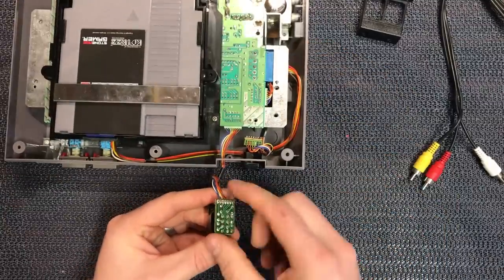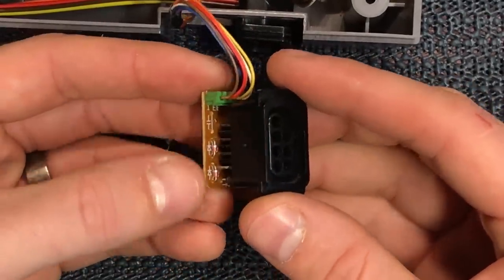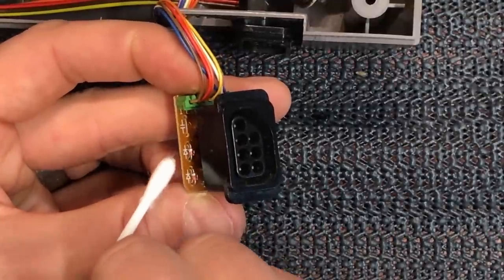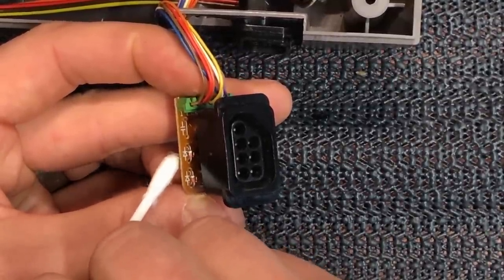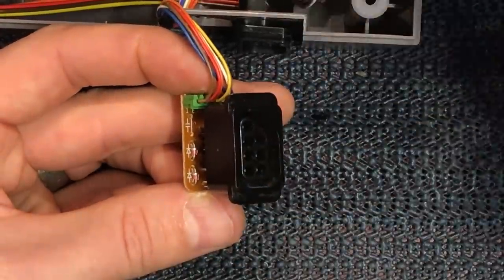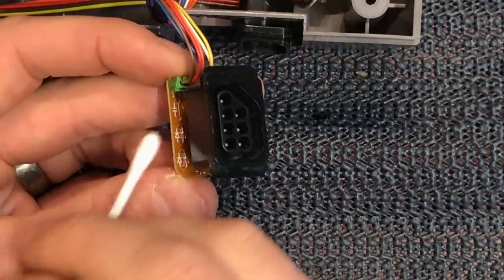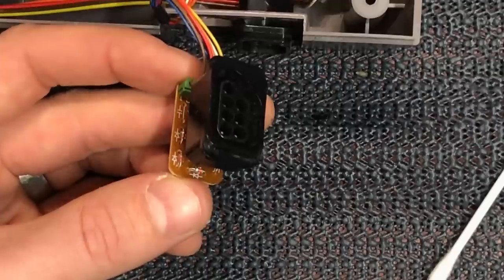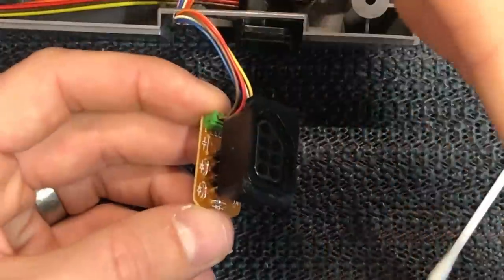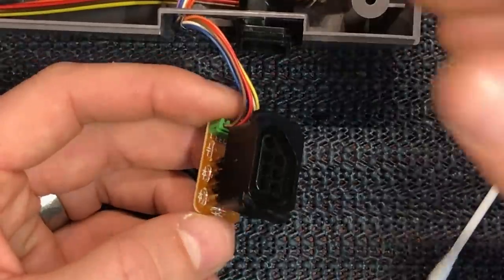This is the one I want to modify today. Just give it a bit of a wiggle, feed it out like that, and turn it over. You'll notice on the bottom there are just connectors, and if you look at the board side of these connectors you'll see these little diodes. These components with the red stripe — that's a diode. That symbol with a straight line, a triangle, and a line across the top represents a diode, which represents one-way current flow. This side is negative and this side is positive, so current will only flow in one direction. Nintendo have put some trickery inside these — the diodes block one direction of flow. When you plug in the controller, there's corresponding electronics inside that respond to that. PAL controllers work fine on a PAL console but not on a US console, and vice versa. The clone controller, which is basically a US controller, doesn't work on the PAL console.